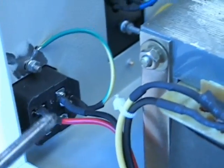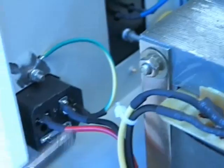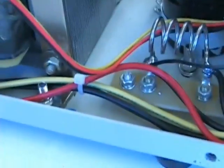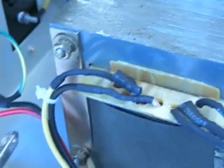These are insulated here, but they're not overall insulated, so you've got exposed mains there — it's just a standard fused IEC outlet of course. Now let's follow the mains wiring. It's got cable ties on it, which is nice, until it gets to here where they actually start bundling the mains wires with all the other signal stuff. There's tiny output signal stuff bundled with the mains wires — I'm not even sure if that's legal.